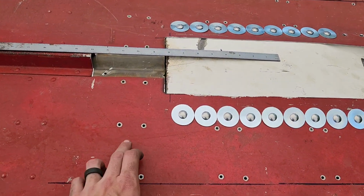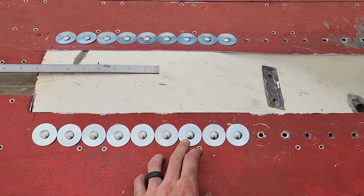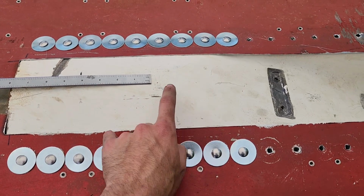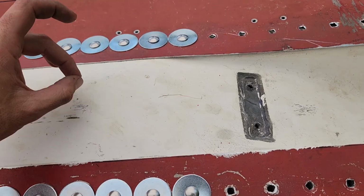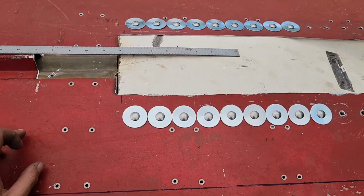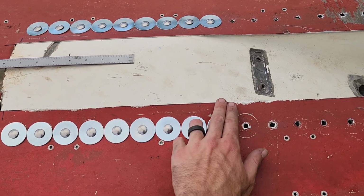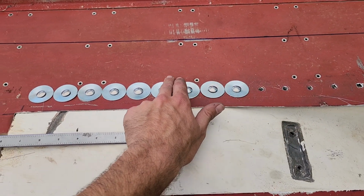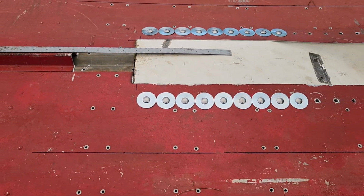And my plate up here, I think I'm going to come on the outside of this row of rivets so I don't have to worry about those. And I'm going to come back that 8-inch distance from here. And I think what I'm going to try to do is finesse a V. I don't know if it's going to pick up on camera, but the fiberglass is shaped to where it'll kind of roll the water down into this tunnel a little bit better. So I'm going to make my plate come from about right here, this corner, all the way down to this V, and then I'm going to come in, up the V, over, and same thing on the other side. I'm just going to come on the outside of these washers, past all these rivets, up to, say, somewhere in there. And I'll get that going, and let's see what we can do.